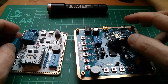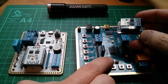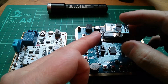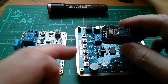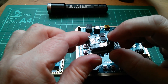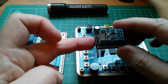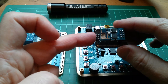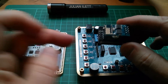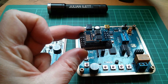As far as the ESP8266 is concerned, I really want to avoid this situation where we have a microcontroller talking to another microcontroller, or even an Arduino talking to the ESP8266. I'm much more interested in getting programming directly into the microcontroller that is inside the ESP8266. This is in itself a microcontroller, and the NodeMCU firmware with the Lua programming language and interpreter looks like the kind of place I want to start working on this. So that's how I'm going to proceed for the moment.